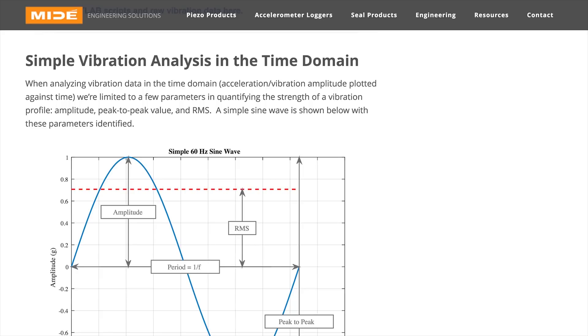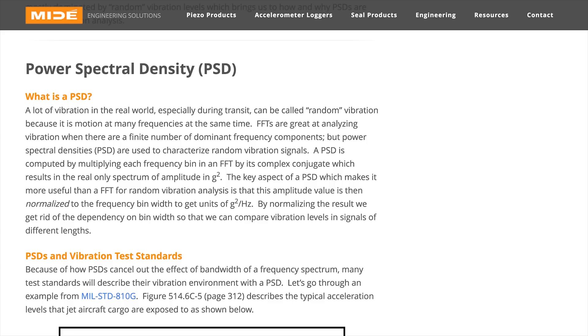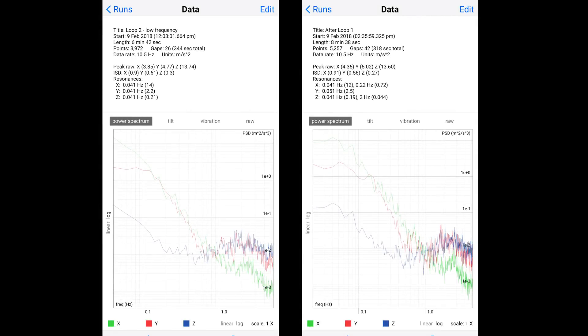Now let's go take a look at the data and see what it has to say. When we look at the basic vibration analysis in the time domain, what you essentially have is a sampling of the frequency, and this is converted into Hertz. They take a sample and there's a specific way that VibeSensor does this. I want to call out one type of chart in particular: the power spectral density, because this is the one I'm using for my analysis. This is how engineers measure vibrations of things like aircraft or car engines. It helps normalize the vibrations against time so that you can compare them — which is essentially what we did here.